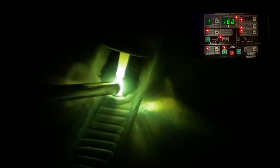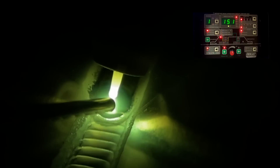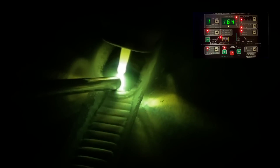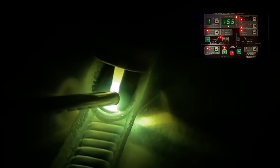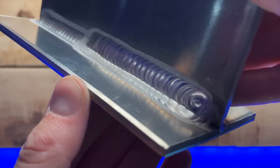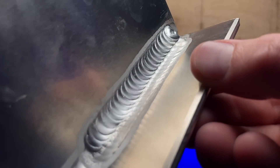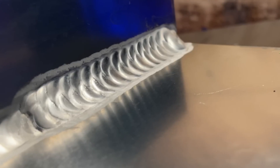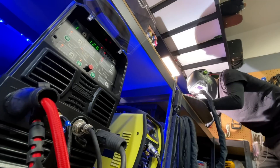This is my personal favorite way to do this. We have a proper root pass done underneath, and now I'm doing something called a split weave. It's similar to a normal weave, but we're doing it in two passes instead of one wide one. First, we fill up one half of the desired width with a single pass — adequate filler, adequate heat. Once I've filled approximately half, I go back and do a second pass, filling up the second half. This gives things a completely different look, and I prefer doing it this way — I can keep things really straight and really consistent. Either way, whether it's a weave pass or a split weave pass, this is one of the safest ways to fill up a bigger gap knowing you've done everything properly.